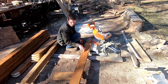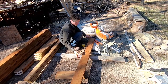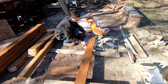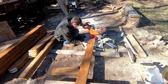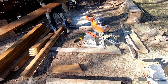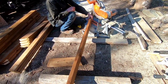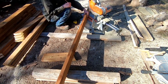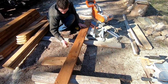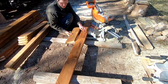On our benches, each side of the bench and the two outside pieces on the tabletop I'm going to cut a one-and-a-half-inch 45-degree notch out of the ends. Just to keep the tabletop and benches looking as nice as possible — commercial lumber is so crappy that I like to keep the bad edges on the inside, so that once you butt two pieces together it hides that and you can keep a better outside edge.